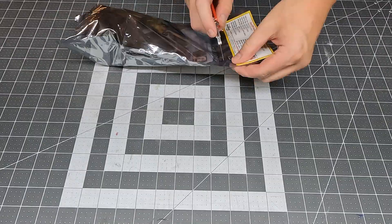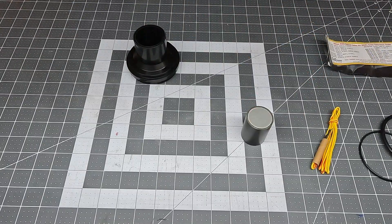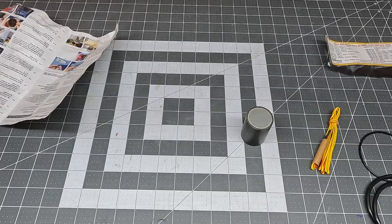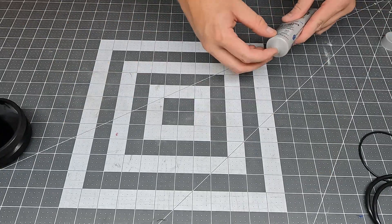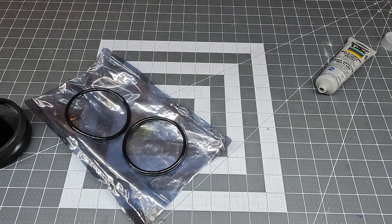If you're coming here to see how to build an N1000, make sure you have a one-inch wooden dowel. First we'll handle the run-of-the-mill motor assembly stuff like greasing the O-rings and assembling the smoke charge assembly. We'll also grease the threads on the forward and rear closures and preemptively put the O-ring on the forward seal disc.